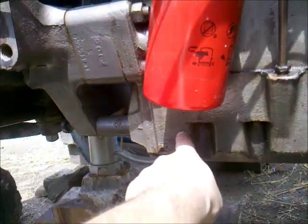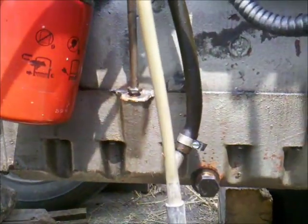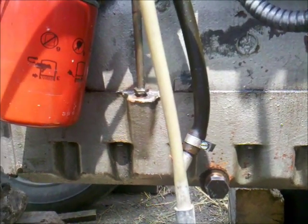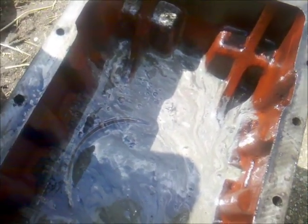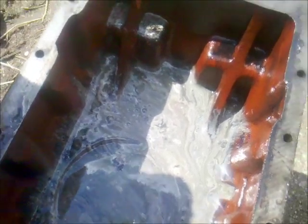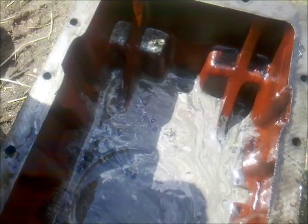I'm going to put out all these bolts, put the jack underneath, and lower the pan down. The pan has been pulled, and that is what happens when you forget to cover your engine — that was my fault, very stupid, but it is like that. And as we can see, there are the fragments of the camshaft gear — quite a lot of them.